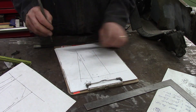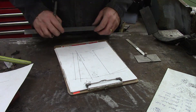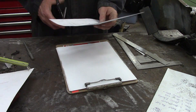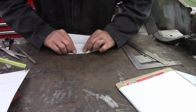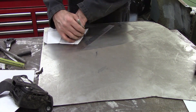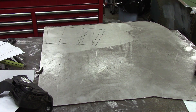This pedal is, I believe, from a roughly early mid-2000s Chevy Silverado pickup. And the way it's shaped fits under the dash of the Chevy of its vintage, but it doesn't exactly fit the more vertical dashboard firewall of my '61. So I'm trying to figure out what kind of shape, what kind of angle I need to make this pedal feel comfortable under your shoe, but also be able to go all the way down to the floor to be full throttle.